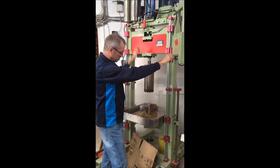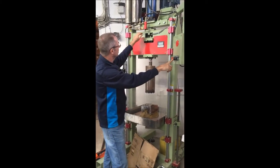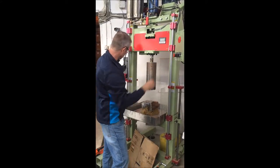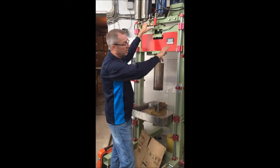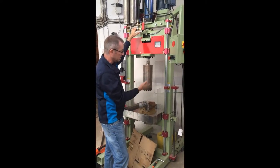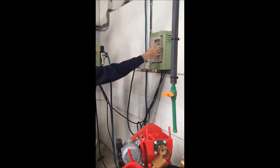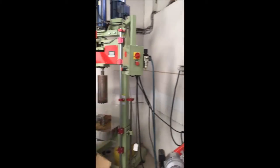And then the pump, which runs your coolant, and the switch right next to your emergency stop is your table up and down — that runs the table motor right here. So on the electrical controls, running the motor and the table, that's all of that. The VFD is mounted on the wall, and there's one control up here which is the speed. This allows you to adjust the speed for each size bit that you're running.